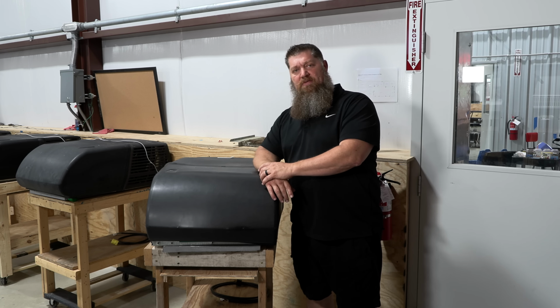Another thing to get besides this right here is just a very thin-toothed steel brush, okay? This is a thin-toothed steel brush, and I could do the same thing. I want to lightly get into these coils and get that dirt off. Now, this brush right here may not fix all these dents and dings. That's a little bit beyond what we're going to do in this tech tip, but this is how we actually clean it, right, is to carefully get this stuff off.